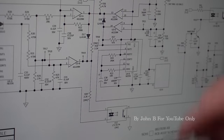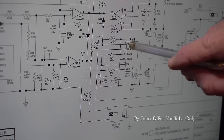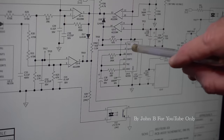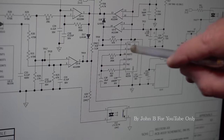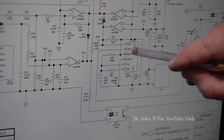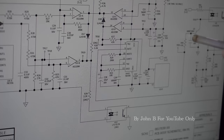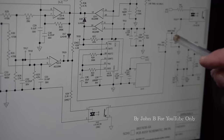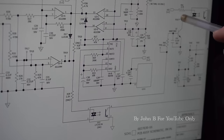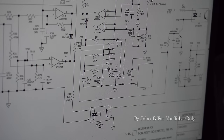So I had to go back, I used to use them sort of 30 years ago. Right, the trigger has to fall below the supply by, is it two-thirds? That has to drop by two-thirds to trigger this 555. You will then get an output. And I had the output, nine volts here, I think, 10 volts here. So that was turning on, grounding that limit line.